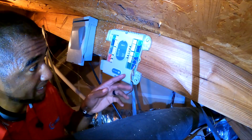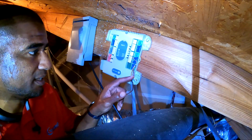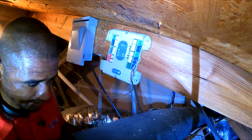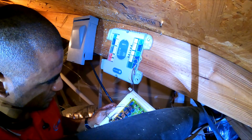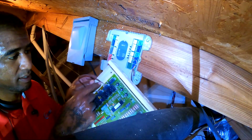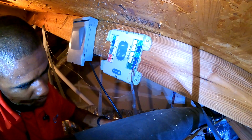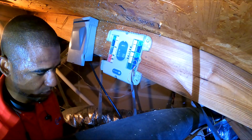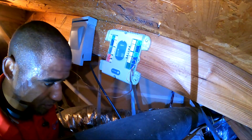We'll find out in a minute if this has to have a common at the thermostat. If this has to have a common at the thermostat, I'll wire this yellow. Well, I'll probably change the common to blue and wire it into the thermostat. But we'll see. All right. So zone 2 damper. These right here, zone 2 damper.